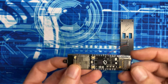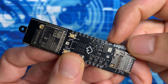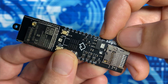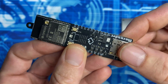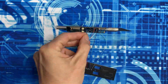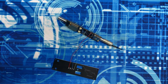Now that our GPS board is all prepared, we're going to solder it to the dev board pro. Black ground goes to the ground pin, red 3.3V goes to the 3.3V pin, TX which is blue goes to pin 21, and RX which is green goes to pin 17. One quick note: we want the wires coming off the top of the board facing out.